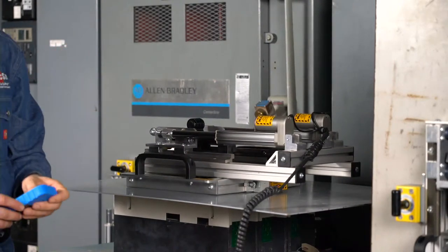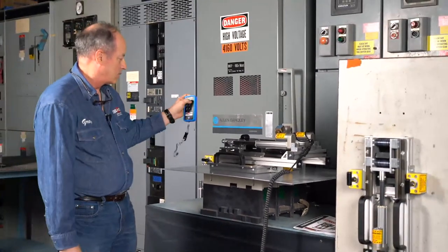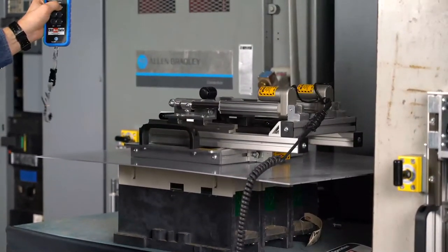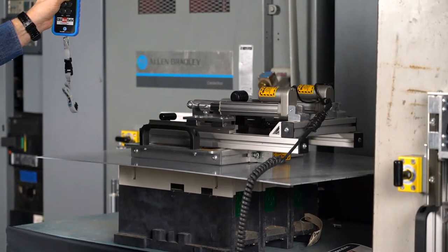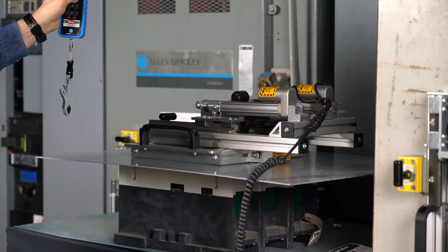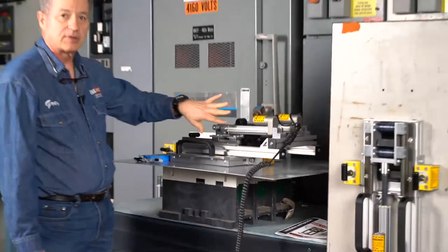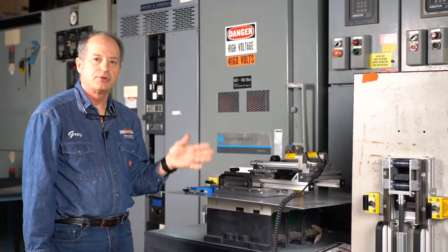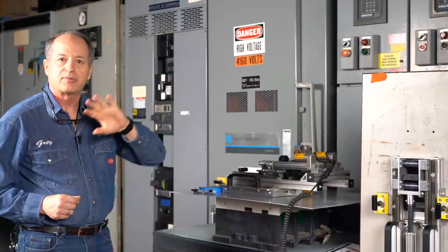And then let's say that the breaker tripped internally, and then could we go back to a reset position? Or if you want to reset the breaker because it's tripped, you actually have to come all the way down to the complete open position to be able to reset the breaker. And then we would be able to reclose from there. But again, if you've had a circuit breaker trip, do your troubleshooting. Figure out why it tripped. Don't just want to turn it right back on right away.